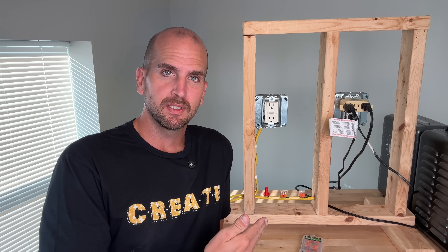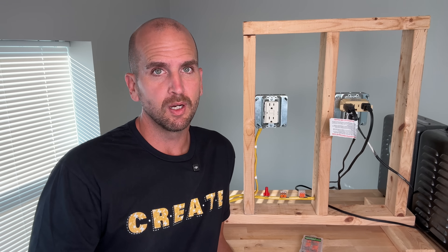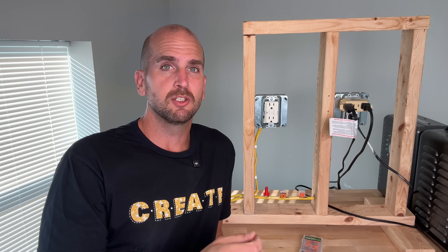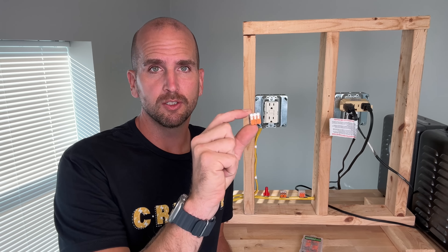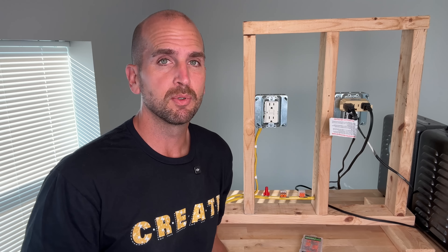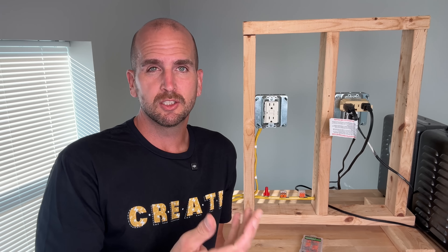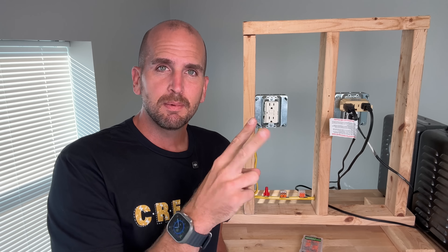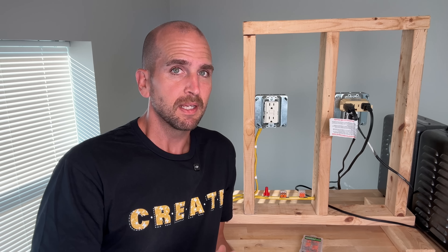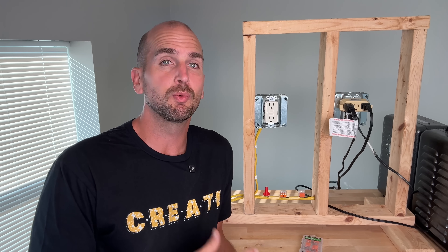After looking at the features and doing the testing, I was honestly pretty surprised with the performance of the Harbor Freight — it really was neck and neck with the WAGO lever nut. I prefer WAGO because of the features we talked about, and the 400 series being so much smaller makes it much easier to fit in a junction box. For clarification, the 400 series is 20 amp certified through UL testing and the 600 series is 30 amp certified. Remember, the Pittsburgh or Vanguard or Harbor Freight version — I don't know what amperage it's actually certified for. It is UL listed, but the confusion on the box between 10 gauge and 12 gauge on the back is a real concern. So personally, I am sticking with the WAGO 221.